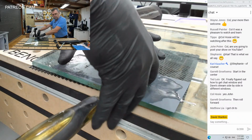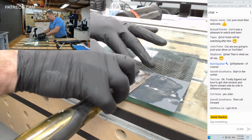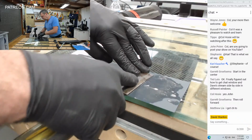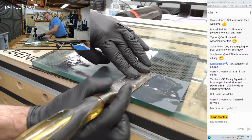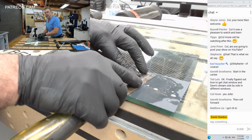And see how I'm holding it? I got my hand underneath the chisel here supporting it so it doesn't drop down. I've got fingers over there and there, so this is right in the middle of the chisel. And then I'm holding onto the blade as well. And these two fingers, finger and thumb, I should say, let me put them up on that side. They're getting an equal space there as well. So I'm working the equal pressure over the whole of the back of the chisel.